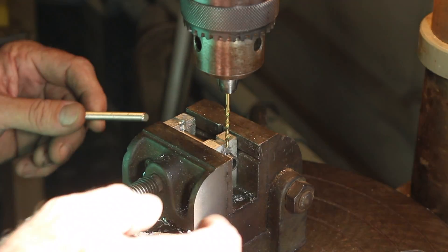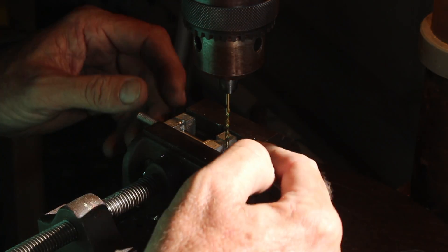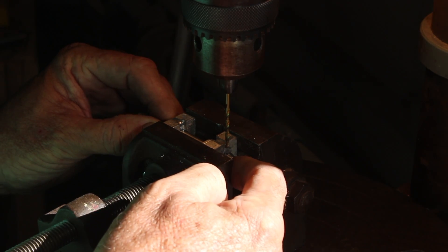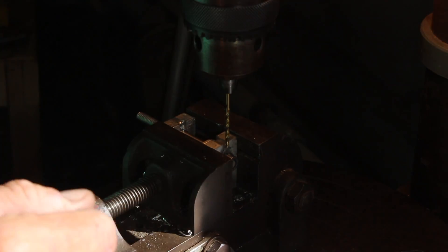To become the clamp maker, this slotted tube needs a couple of parts. One of which is a piece of stainless steel threaded rod with a hole drilled in it. So next we're going to have to drill a hole in the end of that to accept a roll pin. I've constructed another jig for that purpose — a piece of stainless steel tubing that I've put a hole in. We'll just put the stainless steel rod into the end, and then drill through that hole.